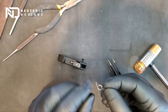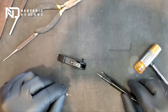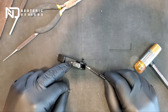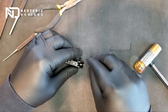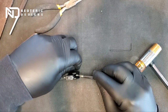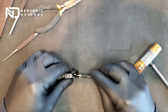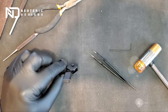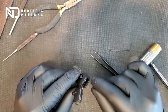Now take your spring. Your spring will have two legs — a short leg and a long leg. The long leg rides along the side of your carrier. The short leg is going to rest right in this portion of the handle. Drop it in and make sure your screw doesn't come out. Push the spring in — if it doesn't go in, that means your allen head screw is in the way, so pull it out. Press it in, and as you press it down, push your allen head all the way through. The spring is now seated and the allen head went through the spring coil, holding it in place.